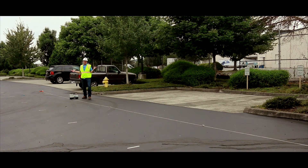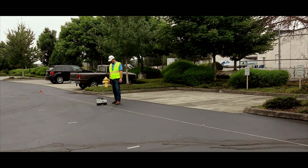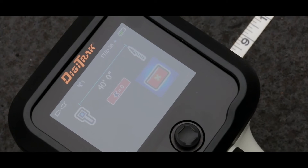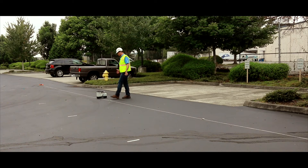For example, if an inspector said they'd really like to see what it looks like at 40 foot because we're drilling at 40 foot today — can you show me how accurate that is? I can certainly conduct the 50-foot calibration and bring it back to whatever distance. I'm going to bring it into 40 foot and let it stabilize. We're reading 40 foot right in there. Once again, all we've done is confirmed we have a good above ground calibration.